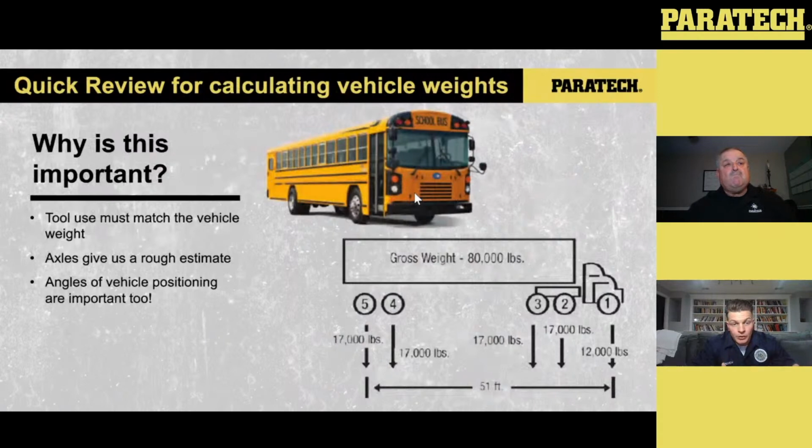So the benefit with the two HFSs, if we tie both of those into the system, is now we essentially have 40,000 pounds that we can lift, or 20 tons, depending on how you want to look at it. Just as an offset, I'm not going to go too much into determining vehicle weight and the classes of vehicles that exist. But just know you have up to 80,000 pounds unless it's special permitted to go down the road. And a lot of that has to do with what the roads can handle, the bridge weight, and things of that nature. So if you're looking at your common school bus,